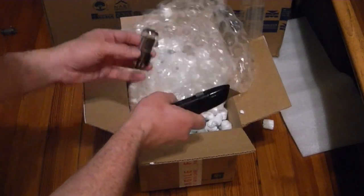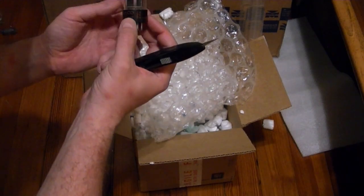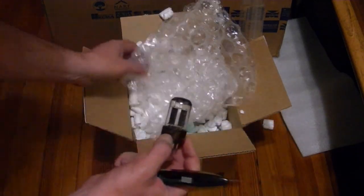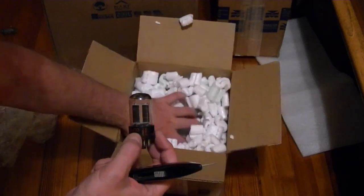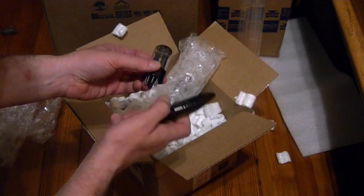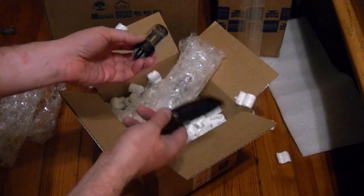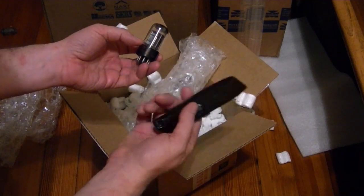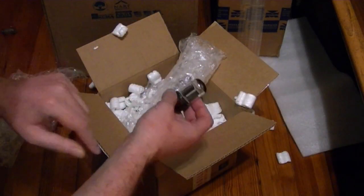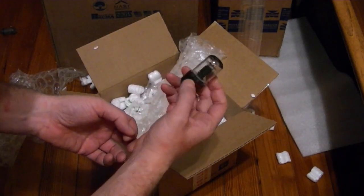Yeah, this looks like a 6SN7 RCA. Oh, no, that's Philco. 6SN7 GTB. So, I am going to unpack these and test them. I guess I'll use my Cardmatic and see how that shows them, and maybe my 600A as well, because it's very unusual for 2 tube testers to test tubes the same, especially they're different models, different makes. And they haven't been calibrated recently. But as long as they test on the good and don't show shorts or leakage, secondary emission, and so on, I'm sure they will work out just fine.